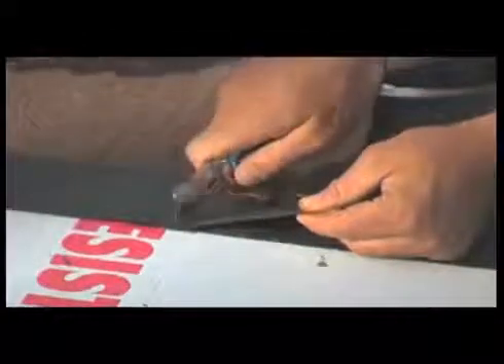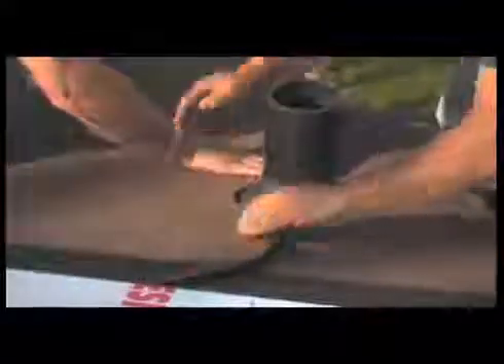Pull the protective film off the non-granulated surface of the previous membrane. Use a brush or small roller to apply a coat of primer, being careful not to get primer on the membrane's granulated surface. The next lengths will overlap on the non-granulated surface. Repeat these steps for enough lengths of membrane to reach the ridge. When joining two lengths of HR cap sheet membrane, plan for an overlap of 6 inches. Cut the first part of the membrane at the overlap at an angle of 45 degrees. Apply elastomeric sealant to the overlap area, then attach the membrane and finish with a small roller, paying extra attention to the overlap edges. For areas around roof accessories, the cap sheet membrane should be cut to adjust perfectly to the edges, then apply a line of elastomeric sealant all around the accessory.